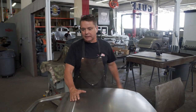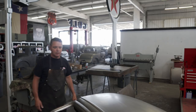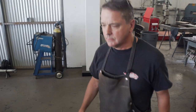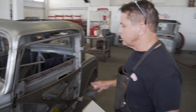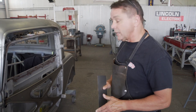We've got our door top attached to our door bottom. Now what we have to do is put a flange on our door so we can flange it to the inner frame. Now that we've made our long walk across the shop back over to the car, we're going to use our inner door frame to make our template for our bend line on our hem for the door.